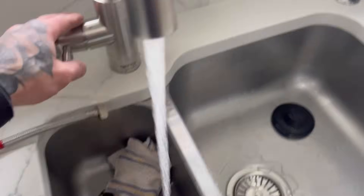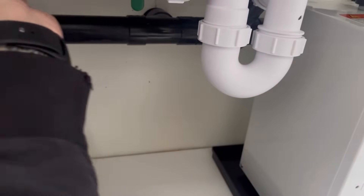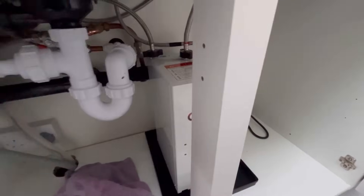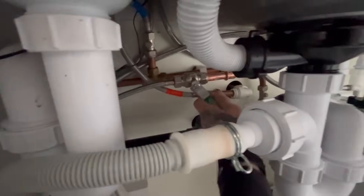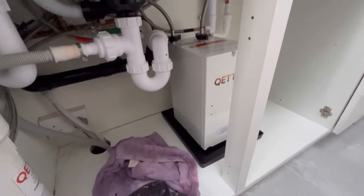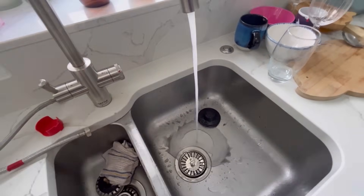Right, let's get the water turned on - a bit of hot and cold to test this. Now I've got to prime the tank first. It says do not plug in or turn power on until water flows from the tap. I've just got to bleed all the air out first. I've got to turn the water on to it first, you idiot. I'll just turn the water on to that tank and purge the air through, which I realised I was doing the wrong way at first.